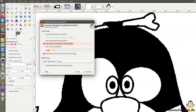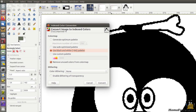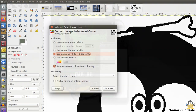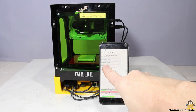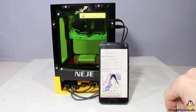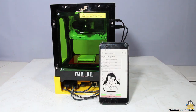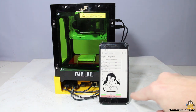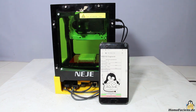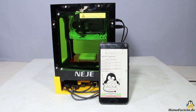The color depth of the bitmap to be engraved must be one bit — in other words, only black and white images are processed. The browser interface can be used to select a bitmap graphic with the corresponding parameters. With a preview function, the laser travels along the edges of the area to be engraved, whereby the light beam is driven with only very low power, so the graphics can be placed correctly.